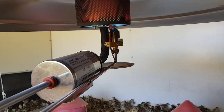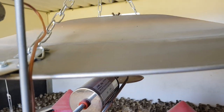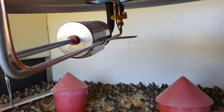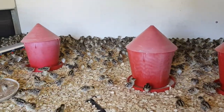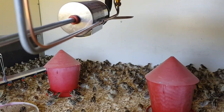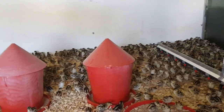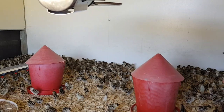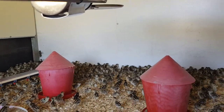It also means that as you burn propane you liberate moisture, which creates a damp environment in your shed. That means the environment in these brooder huts is much drier, less bacteria, less antibiotic usage, and because the birds are always at a constant temperature, they're not stressed — they rear much better. So everybody's a winner: less gas usage, less work to do, happier and healthier birds.